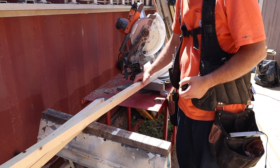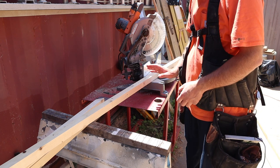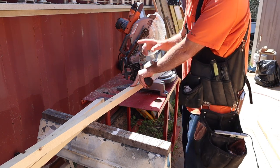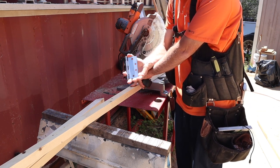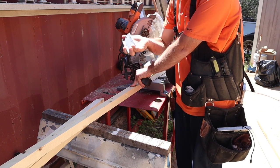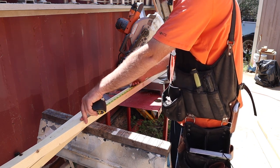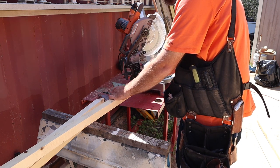Next up I want to do my top and bottom. The nice part about cutting 45s is you don't have to do much math because your long point to long point is what your measurement is for that opening. Don't forget to compensate for your hinges — I put this up against the hinge side and it's going to be 36 inches tight, so I'm going to make it about three eighths smaller: 35 and five eighths, long point to long point.